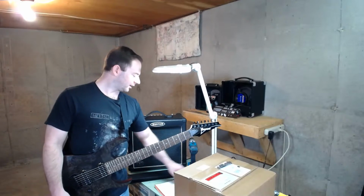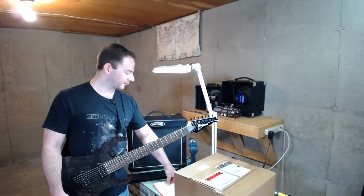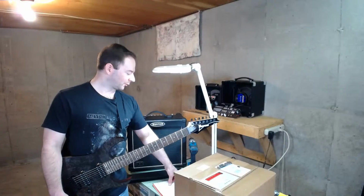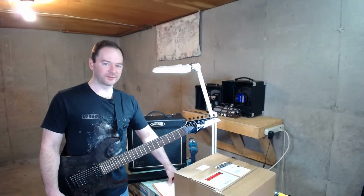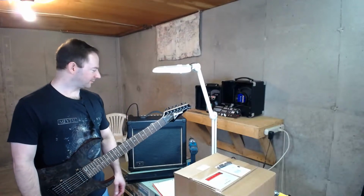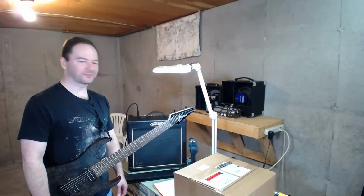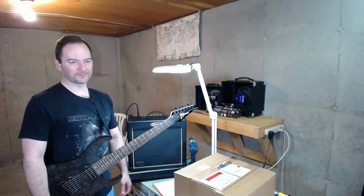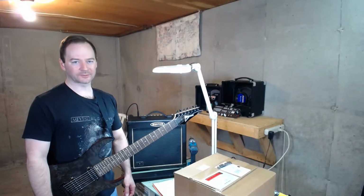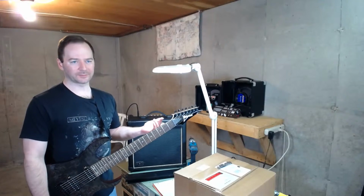Also, I'd say one of the biggest requests, or the most popular request, is to increase the input impedance, which should be doable. Of course, Maurice Diebert, who suggested the Greenback, is also looking for a Vox-type tone, a chimey tone. So that's kind of what I'm going to be aiming for on this with the clean channel. But then I also like distortion too. So what I'm probably going to do is add one or two separate additional channels, as well as modify the stock circuit, to achieve the clean Vox jangly tone, but then also maybe two different types of distortion.